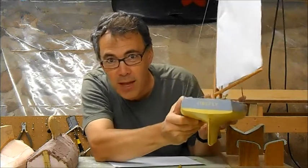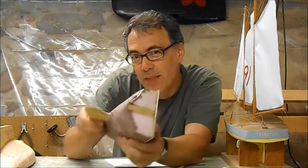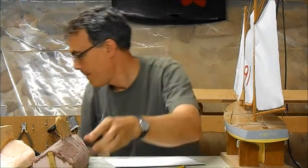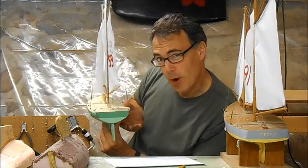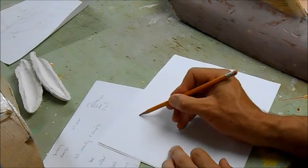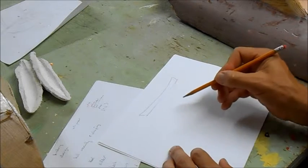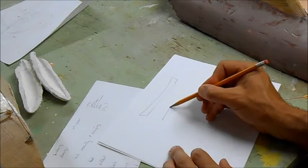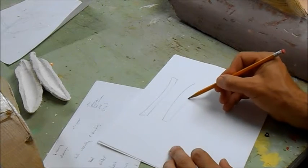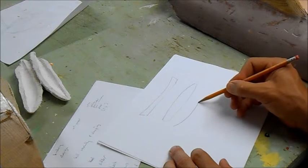One of the things you have to figure out when you're designing a boat is what does the hull look like in cross section. Here's a boat that has a flat bottom, here's a boat that's got a triangular shape, and this boat is rounded. The shear is an important part of the look of a boat. Traditional boats have a nice pretty curve that goes from the bow to the stern. It might also have a racy reverse shear, and a shear might have a couple of different parts — curving one way at the bow and another way at the stern.